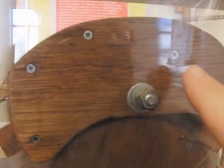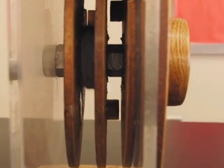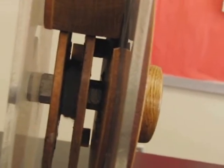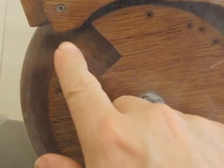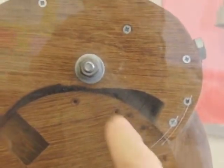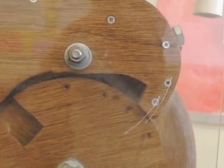If we go to the opposite side of that lever, we find a notch here, and that notch is actually resting against three wheels that are the inside of this lock. Here we are taking a look at the lock from the side — we can actually see the edges of three wheels: the first wheel, the second wheel, and the third wheel. Each one of these wheels has a notch or a piece cut out of it. For this lock to open, each one of these notches has to be in the correct position, which would allow this lever to rotate downward and release the locking bolt.